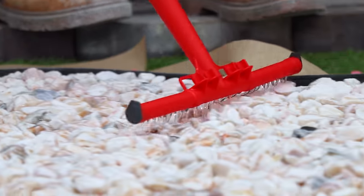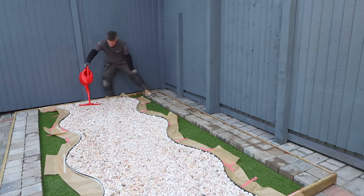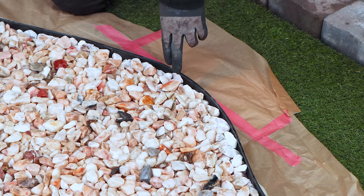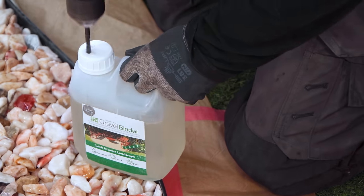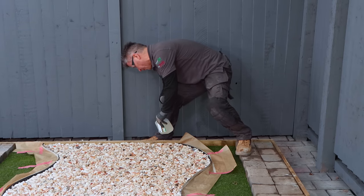It's easy to add more the following day. Don't attempt to lay your resin if the temperature is below 5 Celsius or you're expecting rain in the next 24 hours. Now along these edges here, where the resin hasn't quite got to the edge, I can get another container and pour some on that — either this coat, the second coat, or even the third coat if needed.